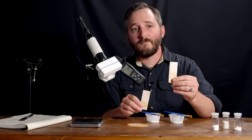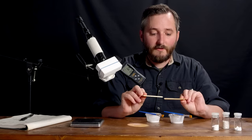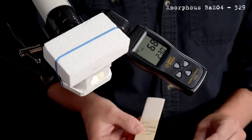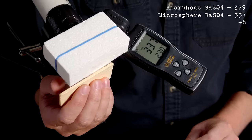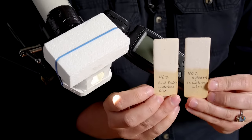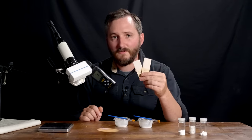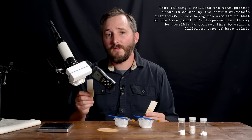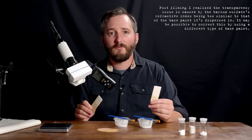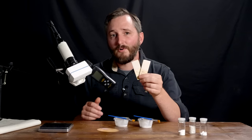Here I have a sample slide of my microsphere paint, and this is my earlier made amorphous barium sulfate paint. Visibly the difference is not as dramatic as I had hoped, although there is a difference — the microsphere paint is brighter white. Under the light meter, the microsphere paint does read a little bit better, but it still has some obvious transparency. Since multiple papers report using barium sulfate in these paints, there must be some unmentioned secret sauce being used to reduce the transparency. My initial thoughts are that perhaps the barium pigment is being mixed with a standard titanium or zinc-based paint, or perhaps the barium paint is only used as a top coat over a layer of opaque white paint beneath it. Both of these options seem less than ideal, and I think achieving the best result will require a new approach entirely.